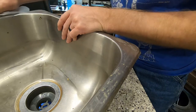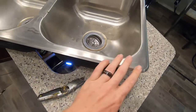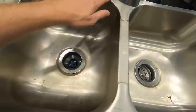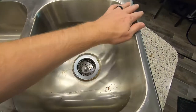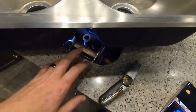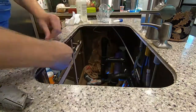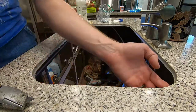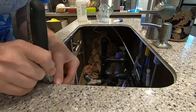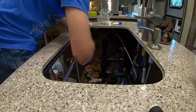It's damp all the way around this basin. The silicone sealant — whatever silicone was used — is coming off pretty easily. We're going to make sure we use a high quality kitchen and bath sealant, 100% silicone, when we install this again to get a nice good seal. Removing all the existing caulking was by far the most challenging and time-consuming portion of the project — it took me over an hour to remove everything before I could start thinking about reinstalling the sink.